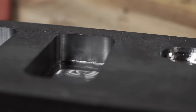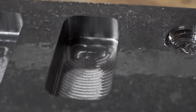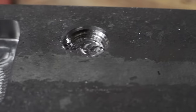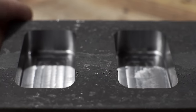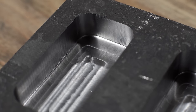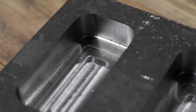I'm sure it was chattering up a storm. And lastly, running this with coolant may not have been the best idea - I'm honestly not sure if you're supposed to run mist coolant on steel. Maybe the intermittent cooling from the fog buster was contributing thermal shock on the end mill, so maybe I should have been running this dry with just air blast. If someone knows, I would love to hear it - leave a comment down below.